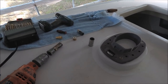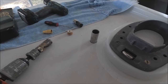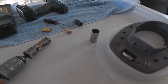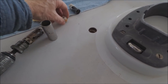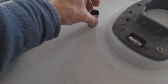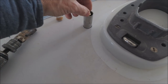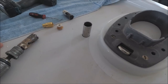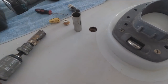We've got four mast light wires and a VHF antenna cable to get through the deck and into the junction box terminal strip to disconnect them inside, just below the mast and the medicine locker. I haven't found any good waterproof connectors that will handle all the wires and the VHF cables, so I make my own using one-inch stainless tubing. From below I drilled a 7/8-inch hole and then on top I drilled a one-inch hole so that tubing can sit on that shelf inside the fiberglass. I'll seal it all up with caulking; first I'm going to epoxy fill that pipe in place.